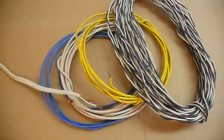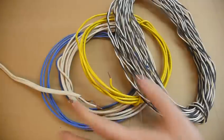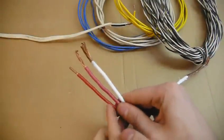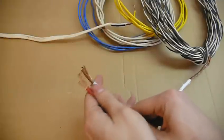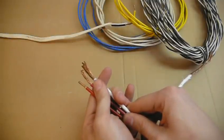As a last, but sadly most common resort, you can use hookup wire. The insulation is so thick that you can reuse old wire from commercial renovations or wherever without much worry. Just make sure you measure on top of the insulation when sizing, and don't just read what it says for the copper size, or your wire won't fit. But here's why it's troublesome.